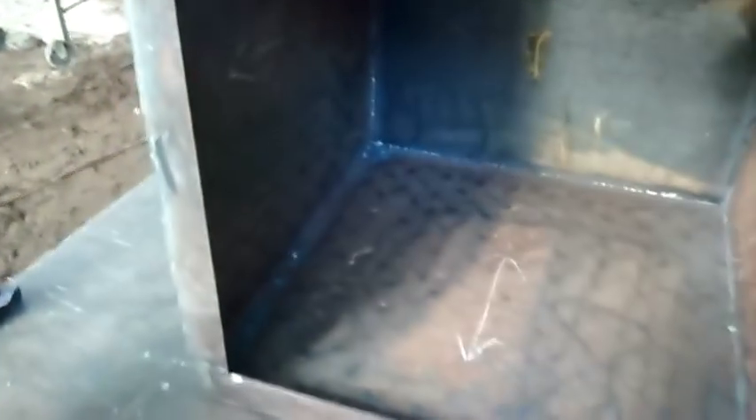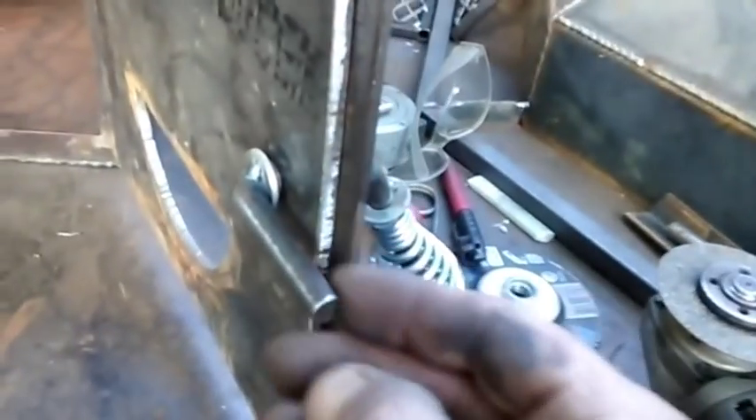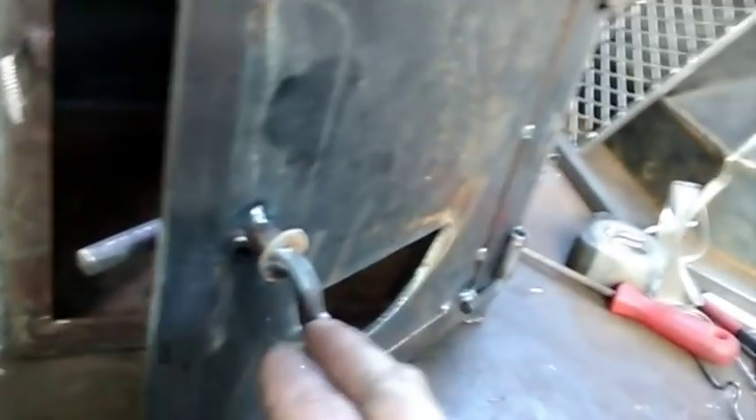All right, so I got the little piece put in there and that latches it up. You can see there's not really any movement in it now. You just twist it up — I hadn't tightened that nut all the way up and that'll tighten that spring up some. You can just move it, then open it up. One thing about this — if it seems a little loose you can try to knock this part in some, bend it in a little bit. If it seems a little tight you can try to bend it out a little bit, but it's kind of hard to do without heat. With that three-eighths round stock you might have to put a little heat on it to make it move, because you don't want to bust your washer or your bushing. So you can see it'll just twist back and forth. I cut it a little bit long and it left that neck part on there — I forgot to cut it off at the end, but it's not hurting nothing.